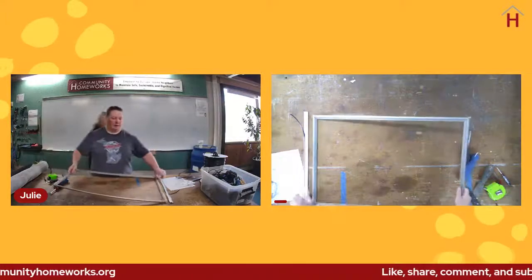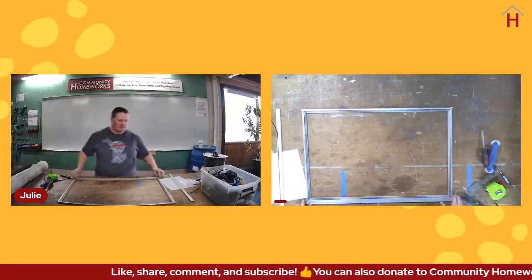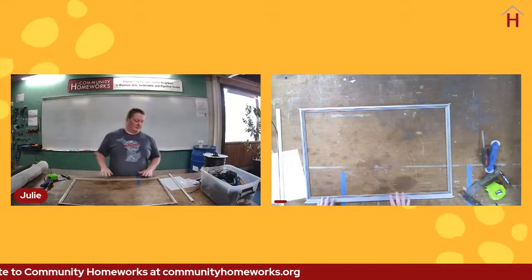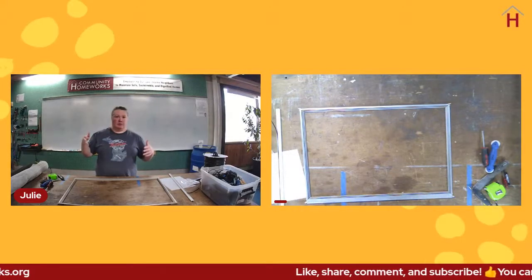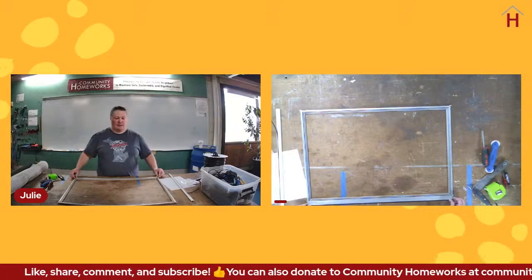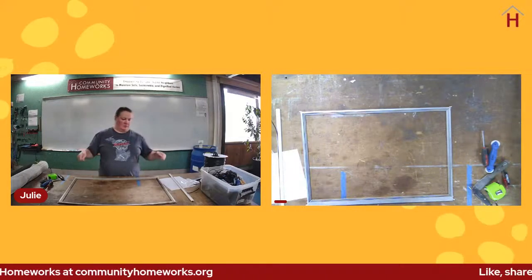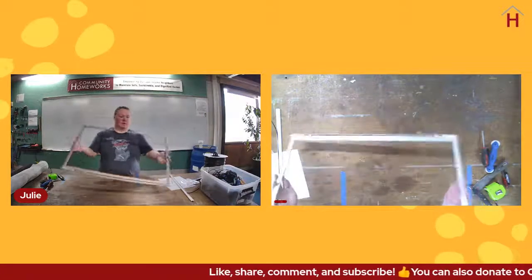So as I mentioned, if you have an older house, you may have either wood windows or even replacement windows that have been outfitted with storm windows on the exterior. The way that storm windows typically work is there are 2 window frames and then a screen frame, and the windows slide up and down so that you can open and close it to use the screen. Some, all 3 panes will move, both windows and the screen. Some, just the windows will move and the screen is fixed.